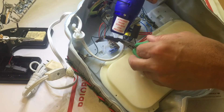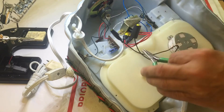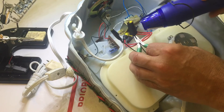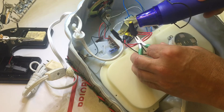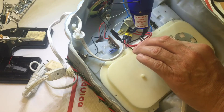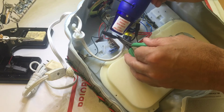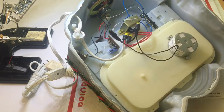Use a pair of needle nose pliers to hold the wires, as this will get hot using the heat shrink gun. Do not put the heat shrink gun too close to the wires or the heat shrink tubing, or it may melt the coating on the wires or burn the heat shrink tubing itself.